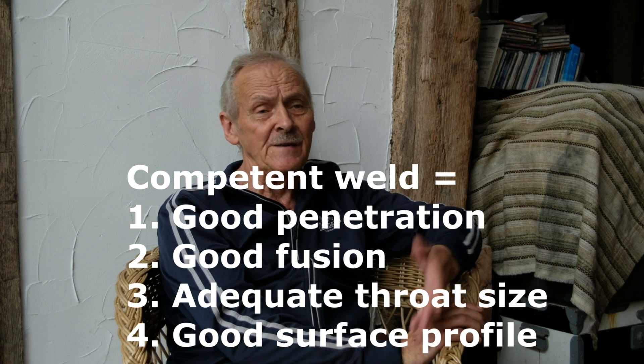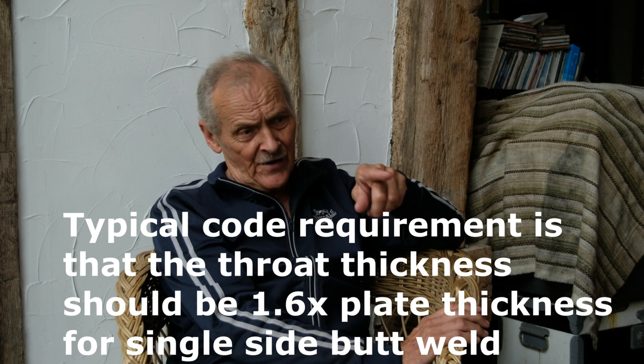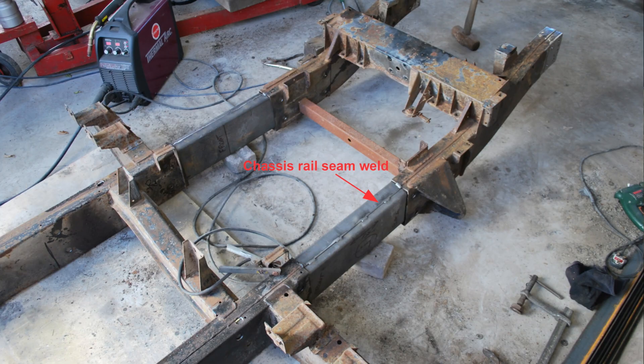But what does this tell us about welded repairs? For the webs — i.e. the side plates — almost any competently laid weld will be adequate to transmit the surrounding stresses, no problem. In the top and bottom flanges you do want to restore the full strength of the surrounding material, and most commonly this would be done with a butt weld. If it's a single-sided butt weld you do have difficulty ensuring full penetration, so I would advocate leaving a bit of weld reinforcement — the crown of the weld should be proud of the surrounding material; don't be too aggressive with the grinder. If you're using lap plates, these will be attached by fillet welds — there are rules for sizing those but that's beyond the scope of this video. The longitudinal seam welds in the top and bottom flanges don't have a lot of work to do as they are parallel to the direction of the principal stresses, so if you've got corrosion there, grind out the rust and lay a nice seam weld to seal it, but it doesn't have to be a full-strength butt weld.